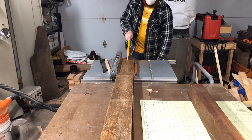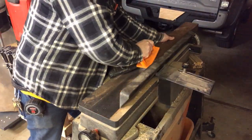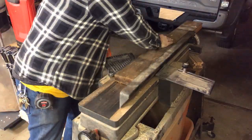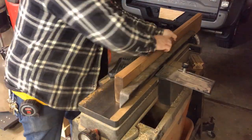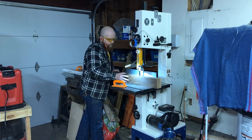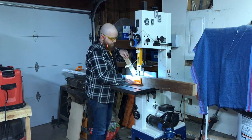The first thing I did is ripped off the tongue and groove that came with the reclaimed redwood — it just was not quite big enough to go over the joiner. After that, I face jointed and edge jointed both the walnut and the reclaimed redwood. The walnut was in a pretty thick block, so I took it over to the bandsaw to re-saw it and make it the same thickness as the redwood before running everything through the planer.